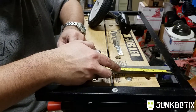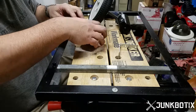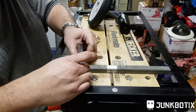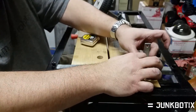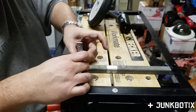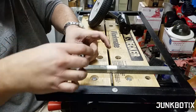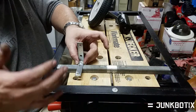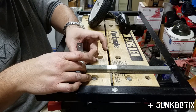So I made a different mark over on this side, same measurement, got it right there. It's a kind of light mark. What I'm going to do is take the bracket and drill out a hole right here, and the same over here — drill out a hole right there. With those holes drilled, I can basically work from there: put the sheet metal in place, mark the holes for these here, mark the holes here, drill them through the sheet metal, mark the other holes, and drill those. Then this thing can start to come together.